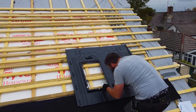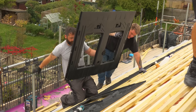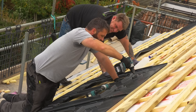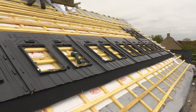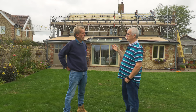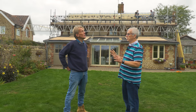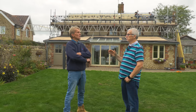This was actually the cheapest way to roof it. Also, you're putting on solar panels - the solar panels are so cheap now, only £75 each and 510 watts. It's an absolute no-brainer. This is a south-facing roof and there are nine going on the south-facing roof. There are also nine going on the north-facing roof. You'll get 60% of the power of a south-facing roof on the north side - so since the solar panels are so cheap, just while we're up there roofing it, we just do the lot.